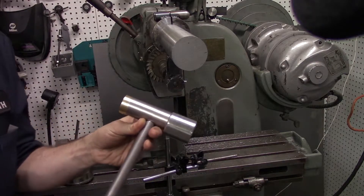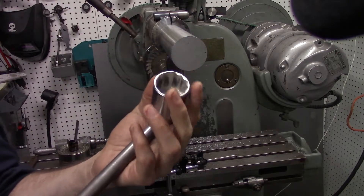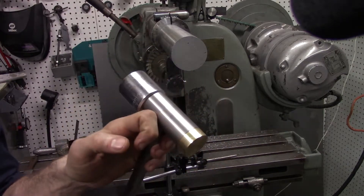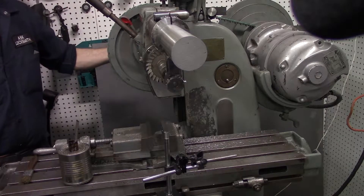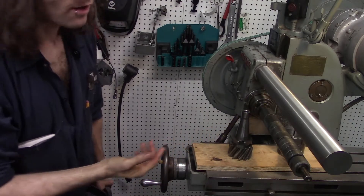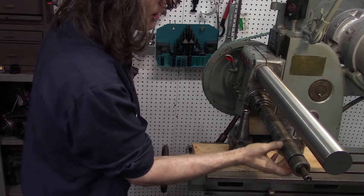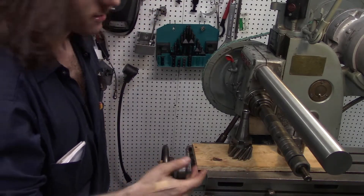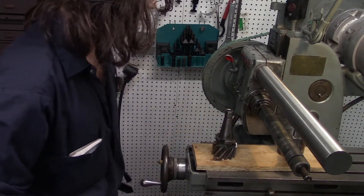I've made one of these — an inch and 3/16 socket on this side, and a little piece of brass on this side, strictly for mounting and demounting arbors. Now that we have a longer overarm on the mill, we can run longer arbors. This is an NMTB A-style arbor, inch and a quarter. And of course, we've got the ice cream cone from hell, also NMTB.